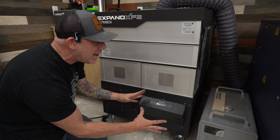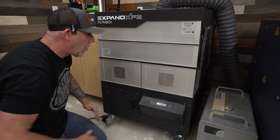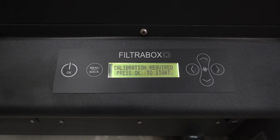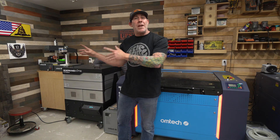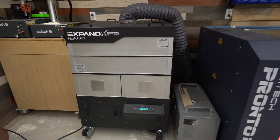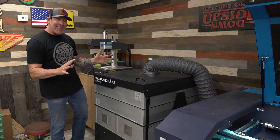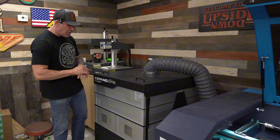The Pronto 40 had a smart card and external fan, so you didn't see me remove any fans — we were able to plug straight into the filter box. Locate the main power switch on the bottom of the filter box and make sure it's in the off position prior to applying power. Now flip that switch on and the digital display shows we have power to the unit. Follow the on-screen directions — it says calibration required, press OK to start. It is now running the calibration process. The manual states calibration could take about two minutes, but it started on a lower speed and gradually increased fan speed. Calibration is now complete — that took less than a minute. Honestly one of the quickest and easiest things we've set up here in the workshop. The unit now shows it's at 30 percent power on manual mode.